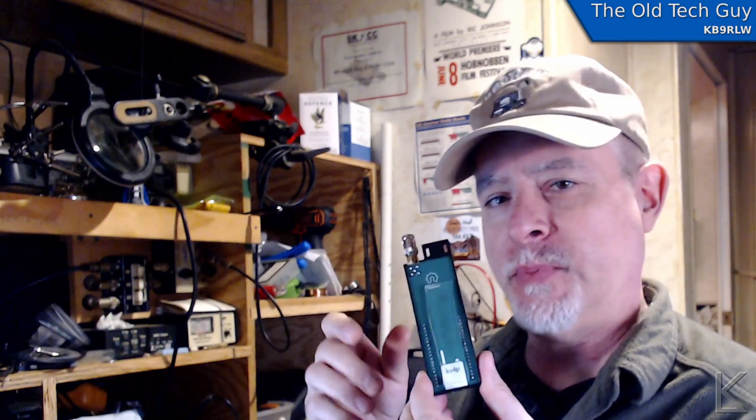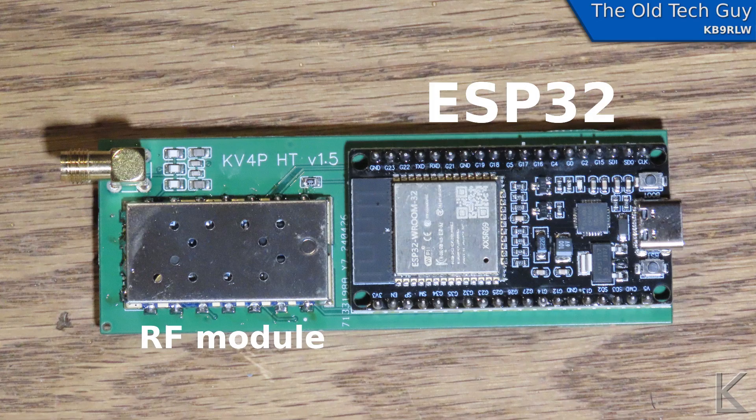He's been working on it for over a year. This tiny little PC board — it comes as a kit — has only three components: an RF module, an ESP32 microcontroller board, and a little SMA connector. This is a female SMA standard type like you'd see on a frequency analyzer, spectrum analyzer, or VNA. So your Baofeng-style antennas, which are the reverse SMA, will not screw on here automatically. You'd have to order one with a specific SMA connector or put a BNC adapter on like I did.